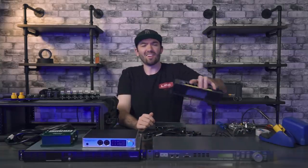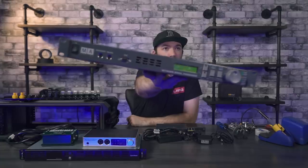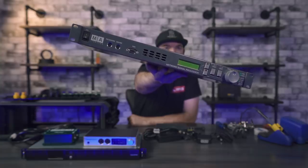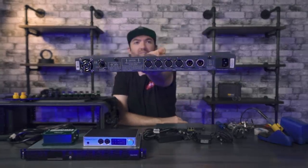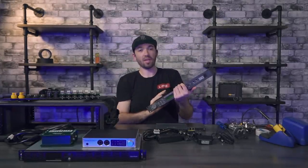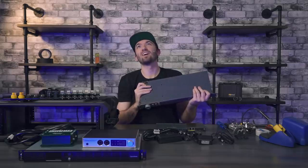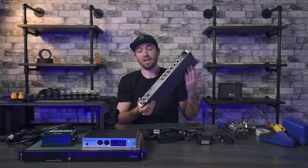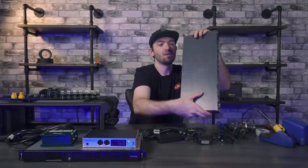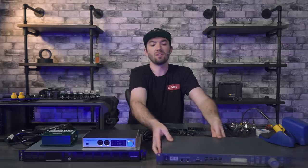And then finally, the most interesting thing on this table, some of you are probably wondering why I'm using a piece of MA1 gear. Yeah, that's right. This is an MA1 piece of hardware. This is an NSP, and it does actually have DMX outputs on the back, and it grants 2048 parameters in MA2, which is important, and that's the whole reason we're using this. This is, annoyingly enough, just a big dongle. It's a network dongle. You have to connect it in with the switch, so that's another reason why we need that activated. So this is going to go in the rack and allow us to control external software from onPC